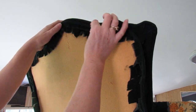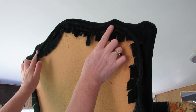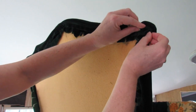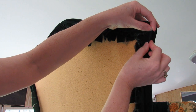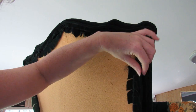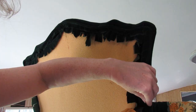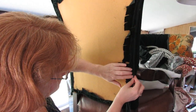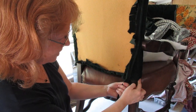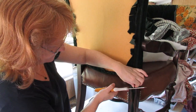I've put in my staple here and brought it round so I can feel the top of the wood here. It'll rise like I did on this side, then down again and into the corner. I'm going to try to make the corner a little bit sharp so it comes to the edge. As I did on the other side, I'm not going to bring it all the way up — that should do here. Bring it down equal to the other side, following the way the chair goes. At the bottom here I'm just going to pop it behind the arm of the chair, and then I'm going to extend it down and cut about an inch further down.